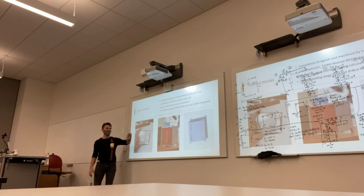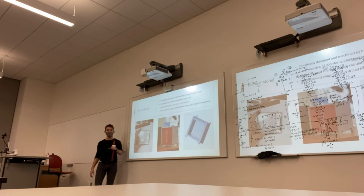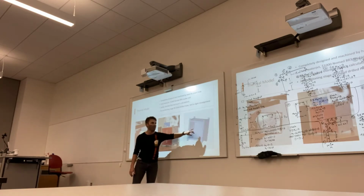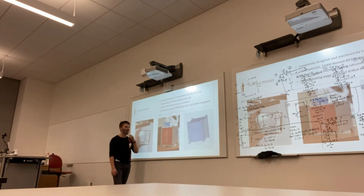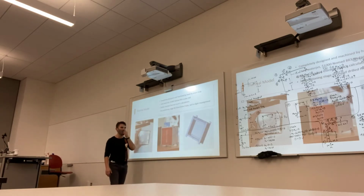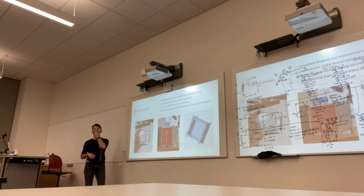This was all water jet, machined, and CNC'd in the Fizz. We didn't go hire some third-party things. This was literally all created there, as you can see from some of the very simple geometries. The side panels here are all water jetted. The top and the bottom panels, those are actually using the CNC routers, funny enough, available in the Fizz. Because, contrary to what they have you believe, a lot of the ones that can do wood, if you run them slowly enough, can also do aluminum.